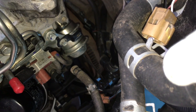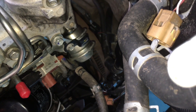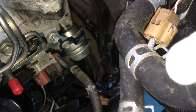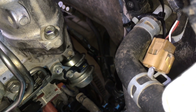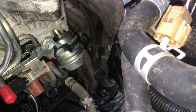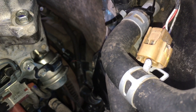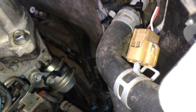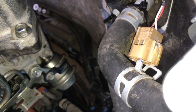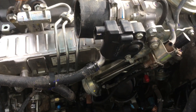It looked a little bit on an angle when it went up in the crane. So go down about 10mm — then it'll fit inside and you'll be able to push backwards a lot more. Maybe it's got to go sideways a little bit as well. From this side it's starting to look like it's getting near. I'll yell out when to stop if the mount's going to hit. Should be able to push it back now — give it a bit of a shove. It's moving backwards now — push the whole crane. That's it.